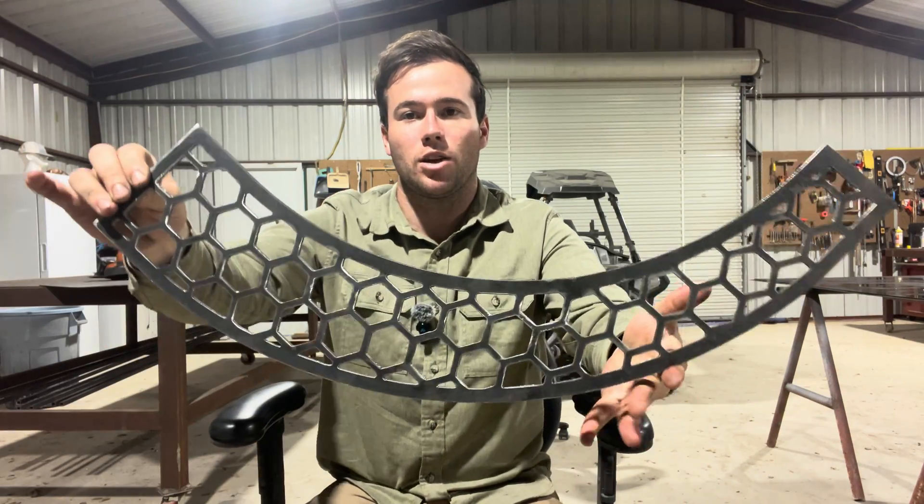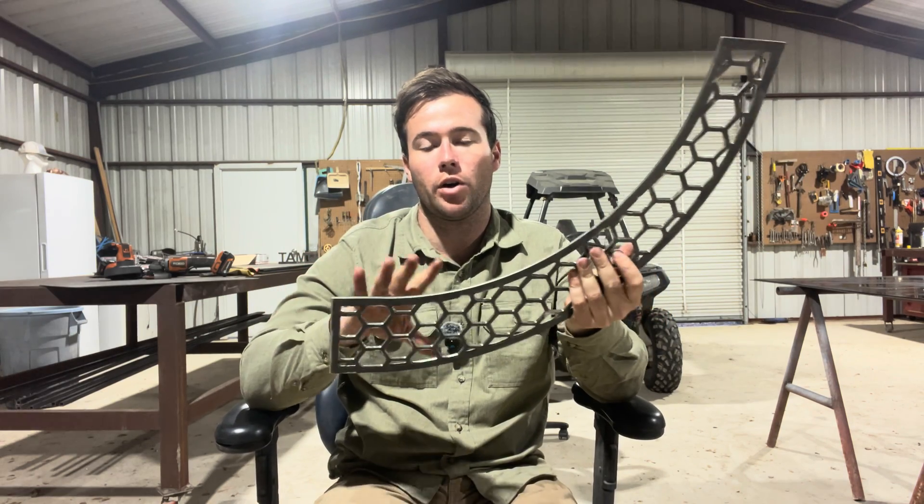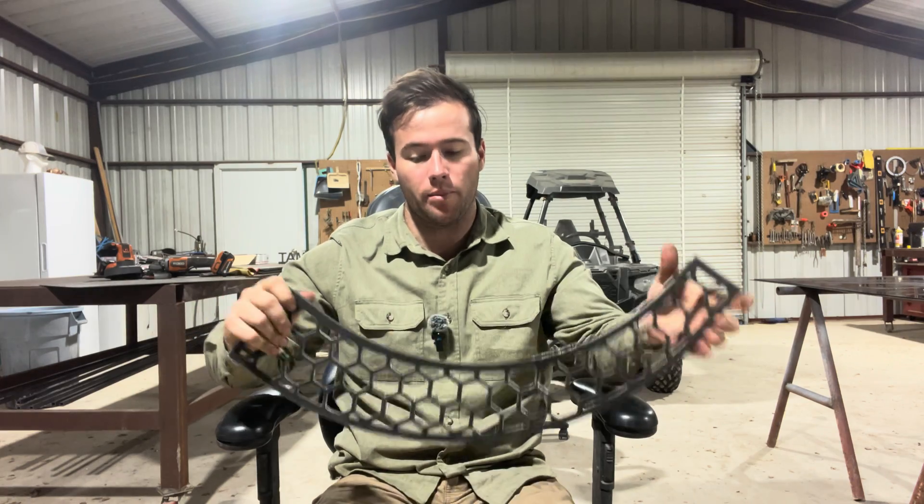And that's going to be a wrap to this video — thank you for watching. As you can see, the computer stand arm came out looking really, really nice. I had to cut two of them out though because my air compressor was cutting on at 75 PSI instead of 95, and this Hypertherm needs at least 90 to keep running, so we kicked it up to 95 and everything's working really good now. Since this video is getting too long, we'll end it here. In the next video we'll be finishing the arm — it's going to be swiveling, so I have more brackets to cut and we're going to wrap it in two inch flat bar to make it like an I-beam shape for more strength. I've also seen things where I can 3D print a laser holder for the plasma torch since it's kind of hard to see where the torch is lining up. If you'd like to see the next video, please subscribe to the channel — God bless and thank you for watching.